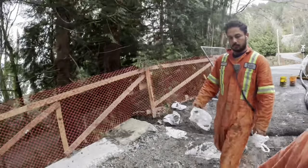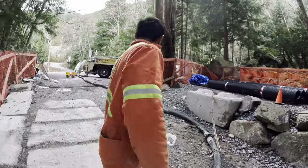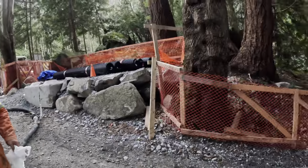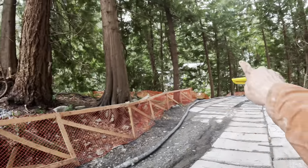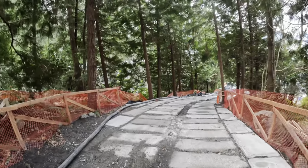And because it's shotcrete, I don't even think that we need to do this today, but we're going to, and then it's going to work, and then everybody's going to say, see, I told you so, you should have used the plastic bag. The last pour when we had the plug, remember we had regular concrete, and it plugged where it tapered down to 2.5 inch. So we don't have either of those elements to deal with here today.